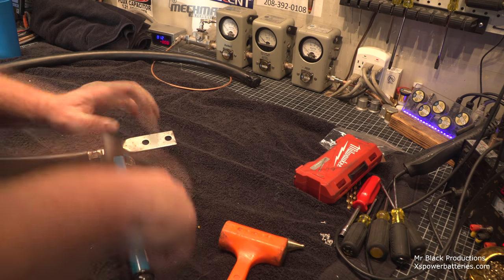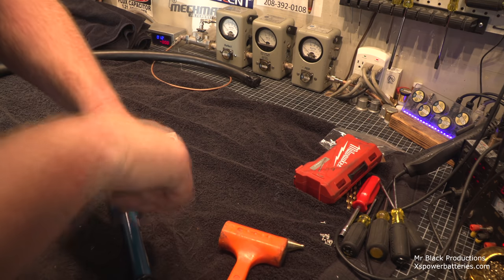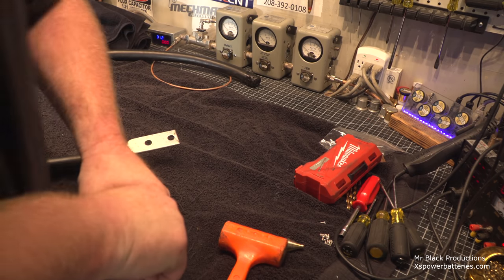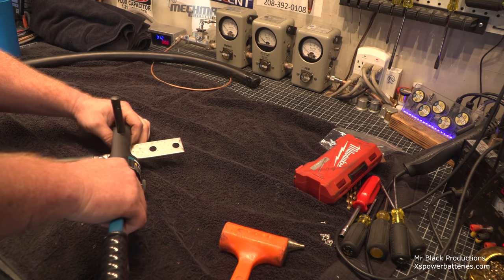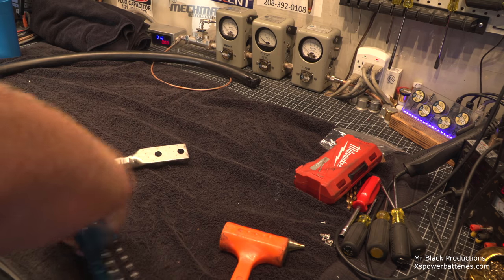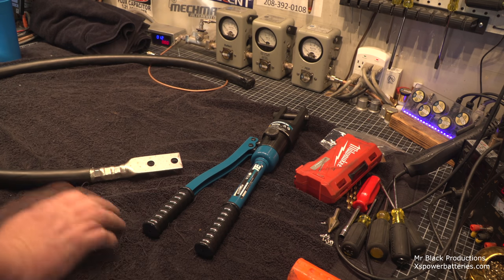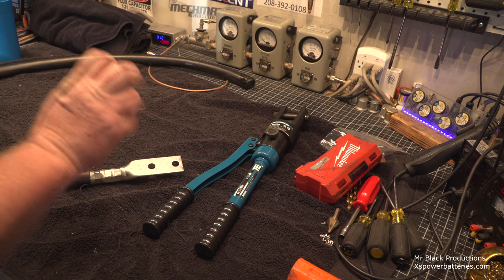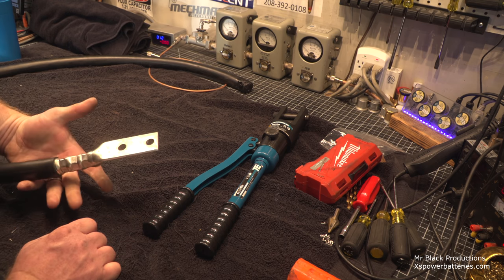So, once again, I'm going to advocate soldering of the eyelet, even though there's going to be guys out there that are like, "What, boy?" Tell you, my friend just did a huge class on solar system installs. And he brought this subject up in this class because we built the thing together that he's currently running. And we took FLIR data and presented it to that class of students and said, hey, there's more to it than just crimping a wire. If you solder it, there's a calculated X amount of efficiency increase. And here's some visual data to help you understand that. And then on top of that, we did amp data, current loss, and efficiency ratio data. And the DC world is very important, I feel. I'll argue that with anybody, anytime.